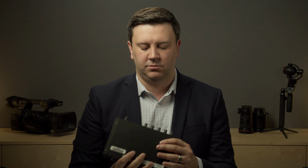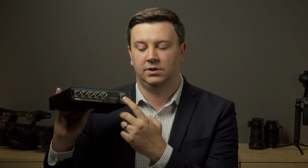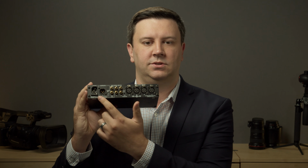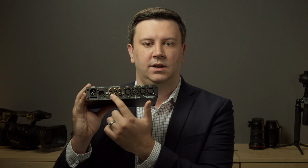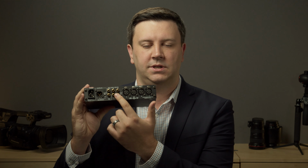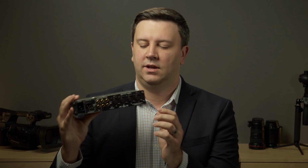A field mixer, and this isn't exactly a field mixer, but a field mixer would look something more like this. This is a Shure SCM268. And so this mixer has 4 volume level controls or gain level controls on the front. It has an aux input control, and then it has a master output control, along with some volume meters. And on the back are the inputs. So there's power, there is the main XLR output, there are some other inputs and outputs here, aux input in particular, and then the 4 XLR inputs are right here.